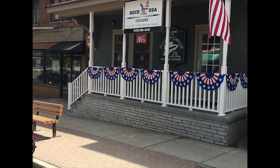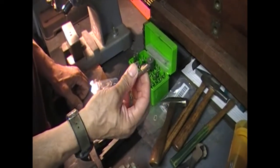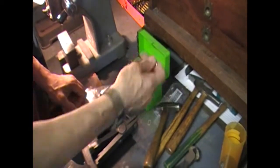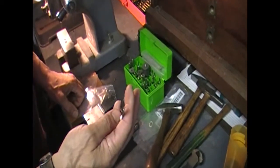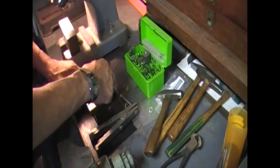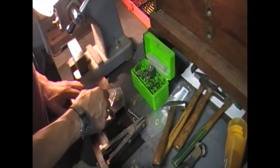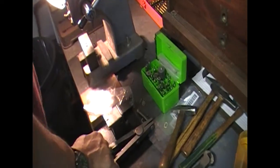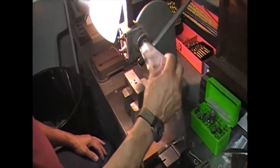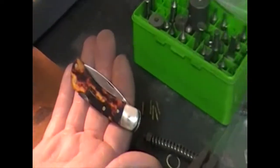These rolled punches were used at the factory in the dies to punch holes. I make tools out of them, and everybody at the cutlery would make tools out of them. A tool like that I use for bumping springs on the back of a knife to make it stronger. A lot of these are used for pushing pins out. Sometimes I'll flatten a pin if I need to with one of these pieces. Over the years I've just come up with little tools that I need to take knives apart and put them back together.